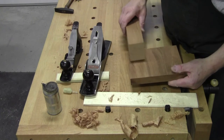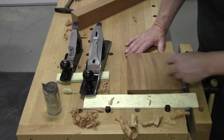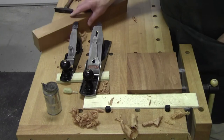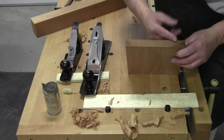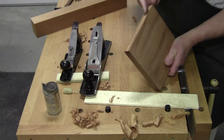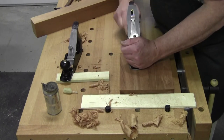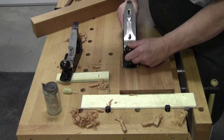This piece is from a different board — it's a little darker in color. The other thing this one has going for it is the rowed wood; the grain's a little different here and there. You see this in a lot of the tropical woods, but we do get it in oak and cherry. It's when every so many years the wood reverses grain direction. So it's like over here I'm planing out this way, and over here I'm planing back this way — it can drive you nuts. But a good sharp blade, finely set, with a nice chip breaker, and you'll get through that work beautifully.